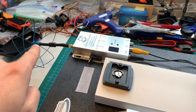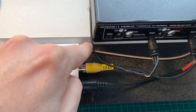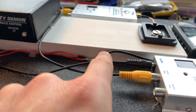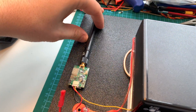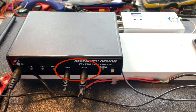In terms of mounting all the components onto the back of the Pepperbox, I've not done anything fancy — I've just used hot glue. The only exception is the DVR, which I've mounted with velcro so I can remove it for charging or if I need to carry it around a field searching for a lost model. The second receiver connects through its video output into RX2 on the back of the diversity daemon. On the other side of the diversity daemon you'll find the two video outputs: AV1 and AV2. I have AV2 running across to the DVR, and AV1 connected to the video transmitter. Note that AV1 and AV2 provide exactly the same output — the two ports are simply so you can feed multiple devices.